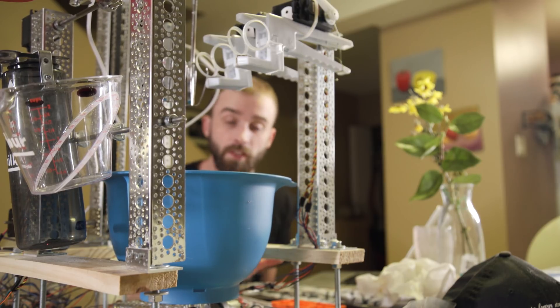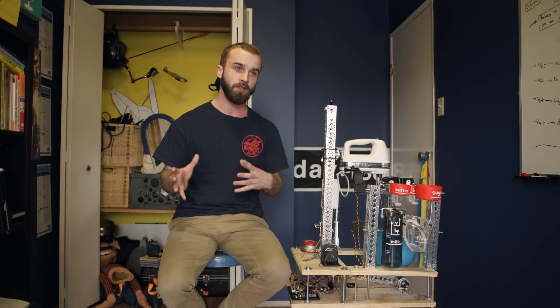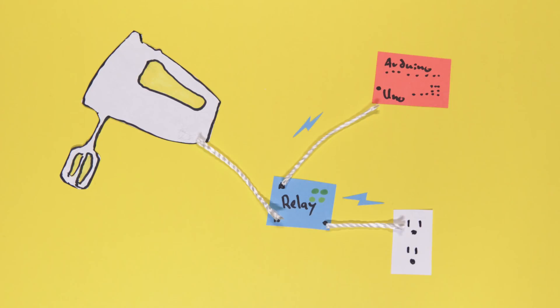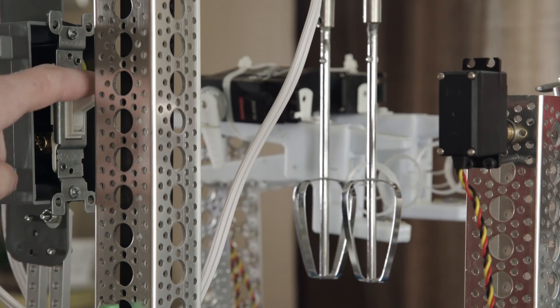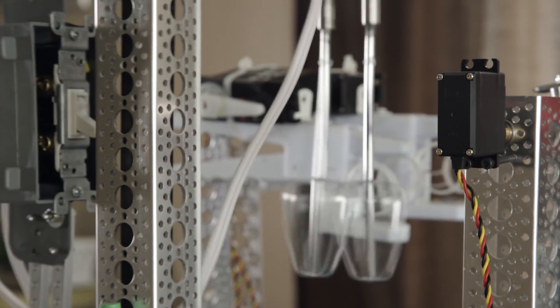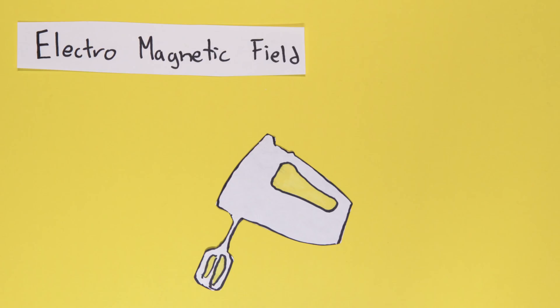The last thing to troubleshoot was figuring out how to mix. I had thought the problem with the mixer was that it was sending too many volts through the circuit, causing it to short. So I tried completely separating the mixer from the rest of the circuit — I built a light switch mechanism attached to the robot that would turn the mixer on going down and off going up, with literally no connection to the rest of the circuit — and it would still happen. At that point I thought the only explanation was some sort of electromagnetic field coming off the mixer. I borrowed my parents' mixer to test for electromagnetic interference next to all the servos, and nothing happened. So I hooked it all up and it ended up working.